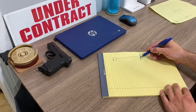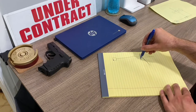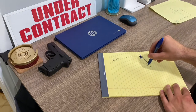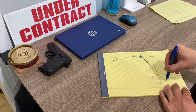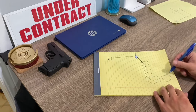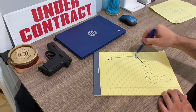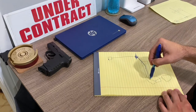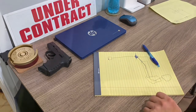I'm going to measure it to length, cut a short wire, and splice it into this hot wire — because this one's hot and I need to run a hot wire out of it. We've made the splice right here and we're running another wire out of it into the fixture. The wire runs through the pipe fixture, down the 90-degree fitting, and out to the little apparatus. That's all this is: from the panel box I cut the hot wire, added another wire, spliced them together, then ran it through the pipe fixtures.